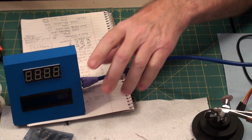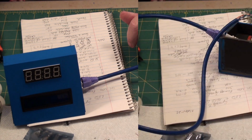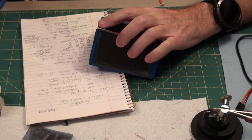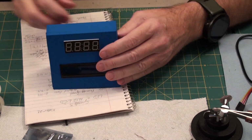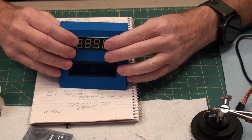So next step is to see whether this works or not, and for that I'm going upstairs on my computer to test it out. Okay, well, I got good news and bad news. The good news is I know that the code works and this cable worked fine. The sensors work fine, so we'll put that aside. Bad news is neither of these sensors work at all actually. And when I do more testing to try and find I2C devices, neither one is found.